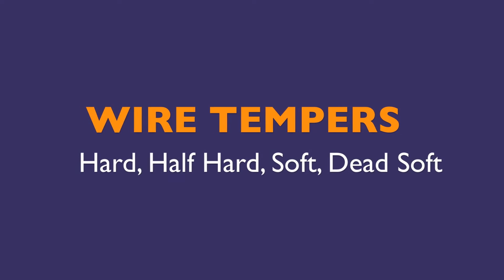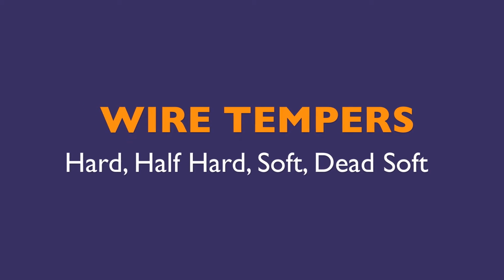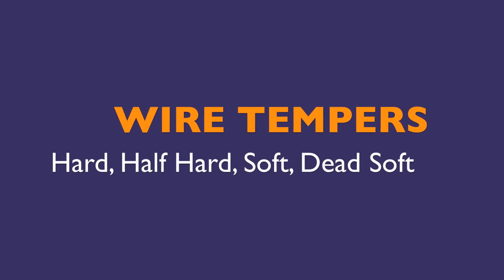Adding heat to the metal causes the little crystals to melt a bit. They don't become completely liquid, but as the metal cools, the crystals recombine and grow large again. And at that point, the metal is soft and easy to work. Wire is sold in one of 4 tempers: hard, half hard, soft, and dead soft.